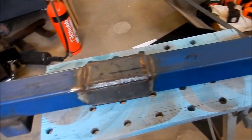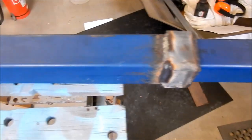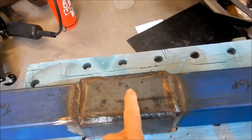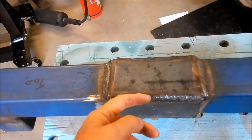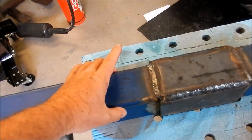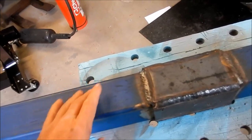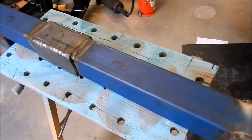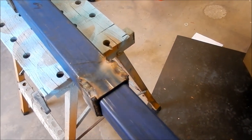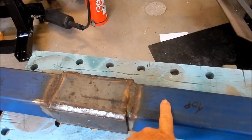This is how it's welded up so far. We've got our support bandaging on the end that's come up very well, and our support point for the clevis. Looking at how we're going to load this - the load goes through these outer plates here and that's where you really want to get them loaded, not in the middle where they will oil-can under load. When I was welding this up it did deform quite considerably - up to two millimeters - and I wasn't able to get the sliding section in at all.